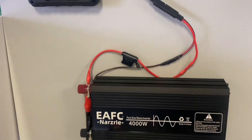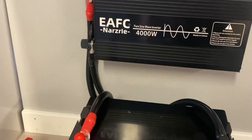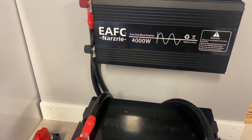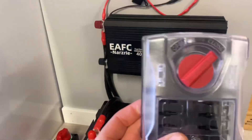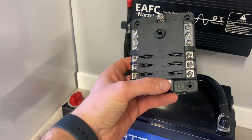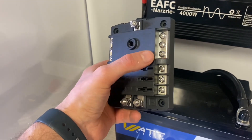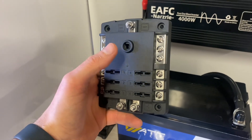If you wanted to add 12-volt appliances or some 12-volt lighting into this system, it could be done easily. If it were one circuit, just add positive and negative cables for the lights right to the battery, or wire up a bus bar system and install a fuse block like this — positive here, negative there, and your positive and negative wires right there. Add your properly sized fuses in these slots and you are ready to go.